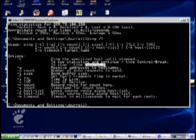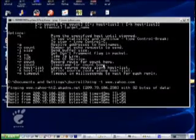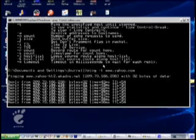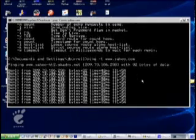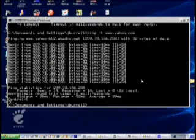This has a lot of uses, including real-time observations of whether or not your host, such as a server you might be monitoring, is still alive and still operating, or at least still answering to TCP/IP requests. And so here we will press our Control-C. You can see from looking at the statistics that we had no data loss. What else has Ping got up his sleeve?